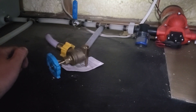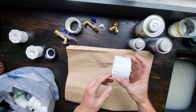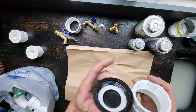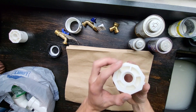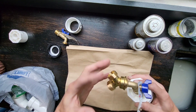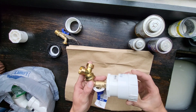Now this hose, instead of going to the 125-gallon tank, we're going to go to the IBC tanks. I'm inside — it's raining out and I'm filling one of the tanks with water. I've got this two-inch PVC that goes from the threaded fitting on the IBC tank — I think it's just standard thread. Then I've got an adapter to go to three-quarter inch, and I'll thread on a quarter-turn hose valve. I've got some glue and some Teflon tape and I'm going to put this together and then put it on the tank.